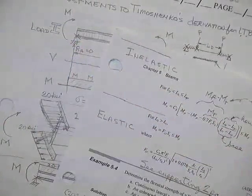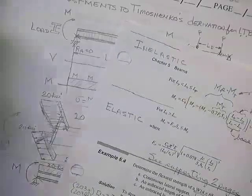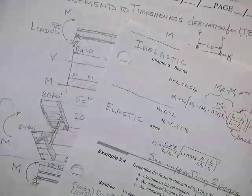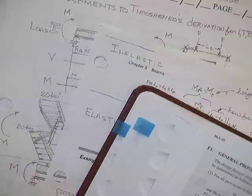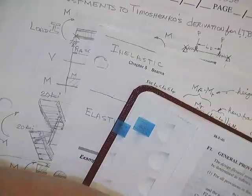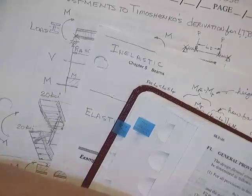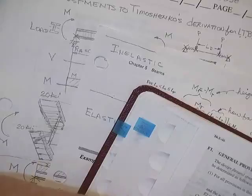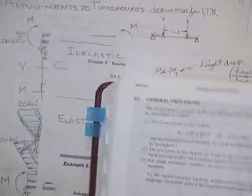So when do you choose whether to use F2-4 or F2-3 in this section? Well, it depends on L sub B. If your bracing length is in here, you use F2. And if it's in here, you use F3. No, F3 calls on F4. See the F critical? That's where you get it from. So they come as a pair. Gotcha. Thank you. Yes, sir.